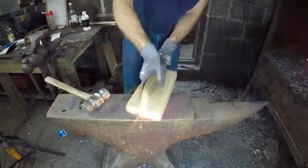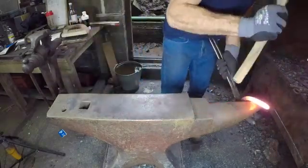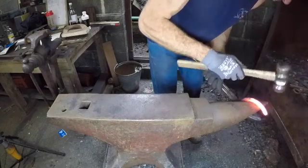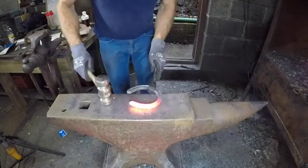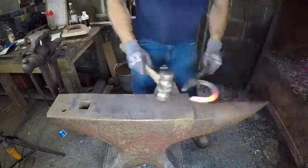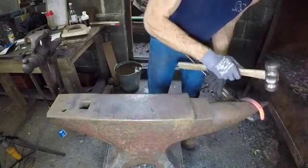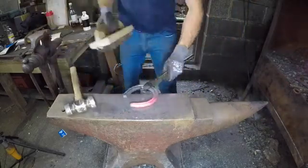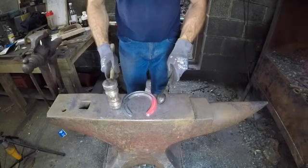This is your final heat on the concave front — you're looking to create a mirror image from the outside branch. Start off where your toe bend left off and gradually work your way round, straightening the shoe on the beak so that it increases the radius and you don't end up with a circle. You're not looking for a circular shape — you're looking for almost a teardrop shape. Analyse the shape and make minor adjustments using the radius of the beak. Keep the shoe nice and flat without overworking it. If you've still got plenty of heat you can give it a quick brush to get rid of any scale.